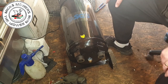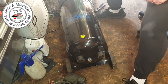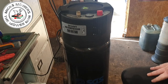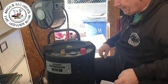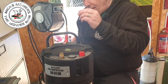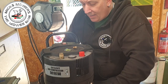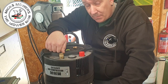Okay, so that is now all the air out of my machine, and I can now take the plug all the way out and put the compressor back up onto its wheels. And that's all they want me to do. Now, all they want me to do is to run this air compressor for around about 10 minutes. They did say 10 minutes, so I'm going to do the full 10 minutes - run it for the full 10 minutes with this out. My regulator will then read properly, or it resets whatever reset function there is in there. If it goes over three bar, I'm laughing. If it doesn't, I'll be going back to them saying I would like a new air compressor, please.